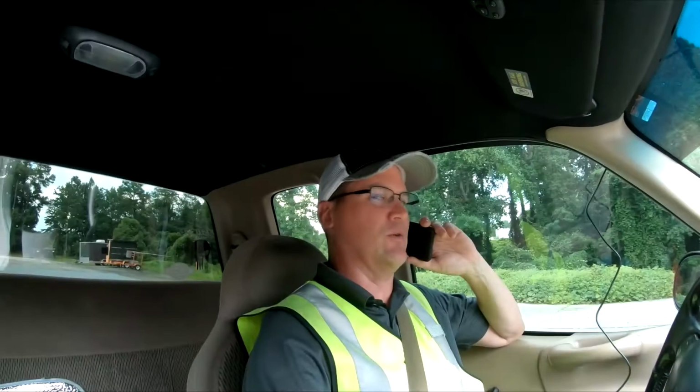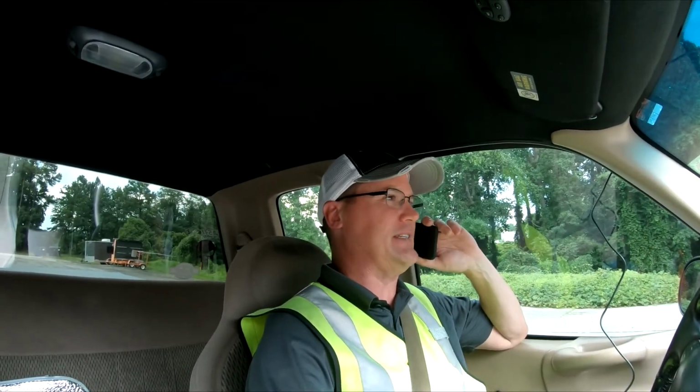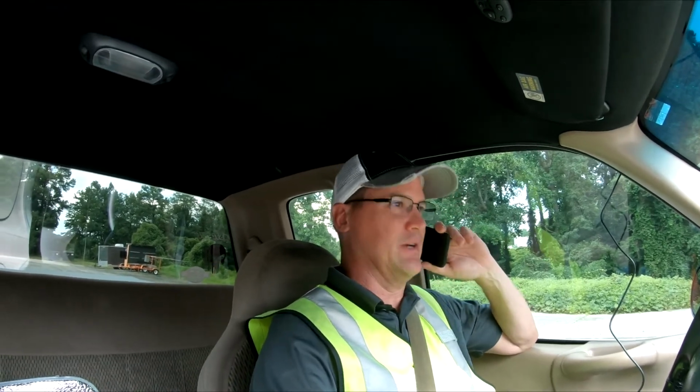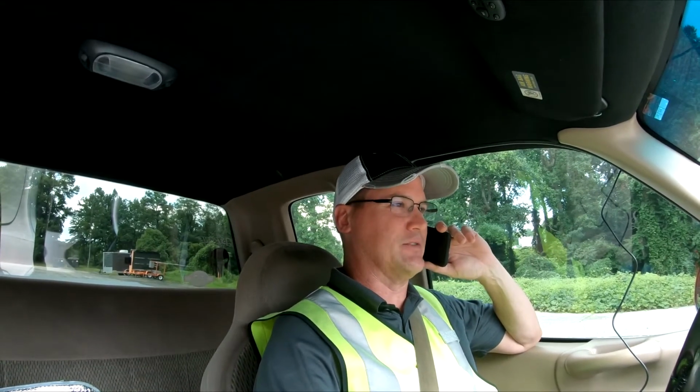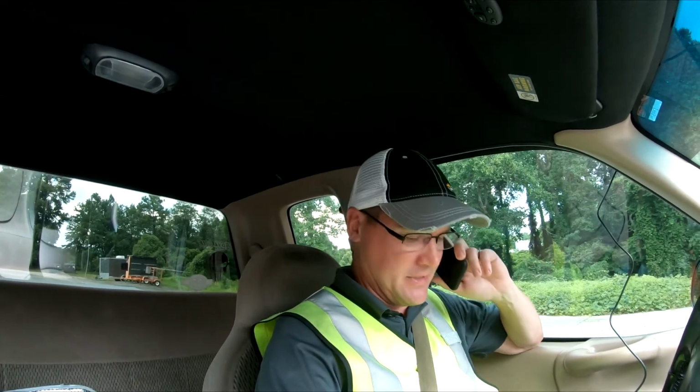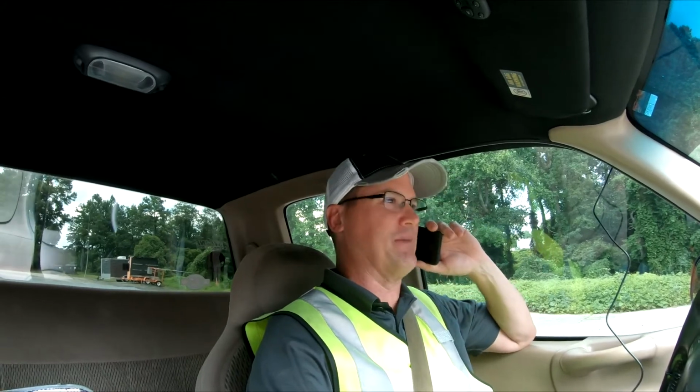So, you have a 98 vehicle? Yeah, you cannot use the OBD cable kit with a 98 with the DMI Pro. The DMI Pro is designed for 2008 and newer CAN bus type of systems. Oh, what year's my vehicle? My vehicle's a 1998 model. Oh, so this doesn't work with pre-2008 vehicles. So a 2008 and newer has the CAN bus system, and that's what this is designed for. So to make it work in my 98, what do I need to do?